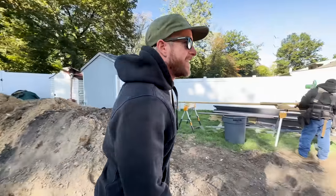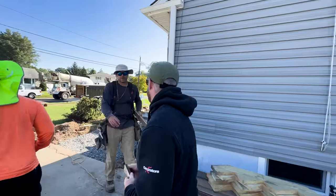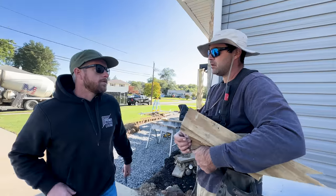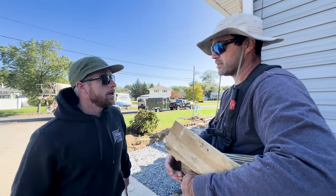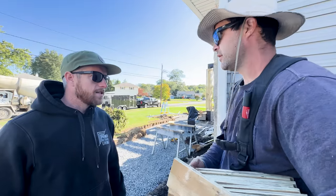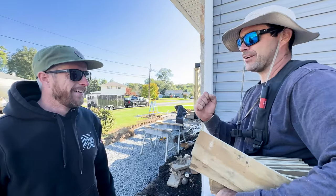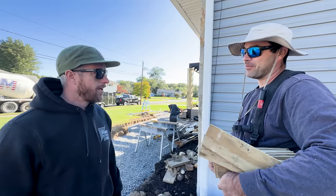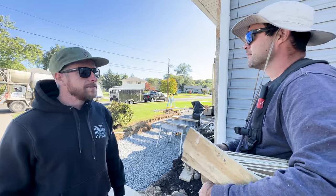Creek's here. Keep it spinning. We're gonna go with a six slump on this. Oh, six? What are we doing on the walls of the fire pit? Just gonna be concrete. Yeah, six is good for that. Yeah, you're gonna get a good vibrator in there. Wiggle the bubbles out.